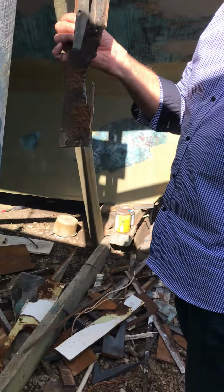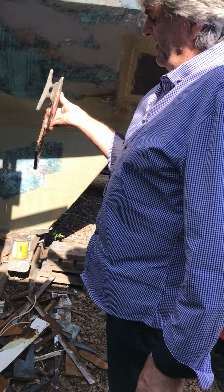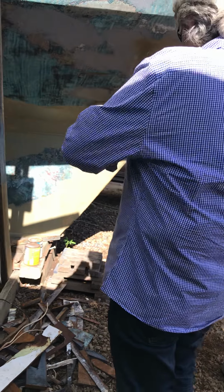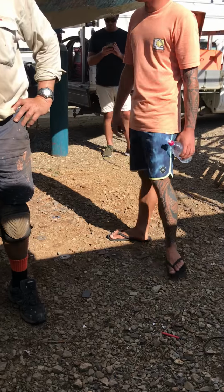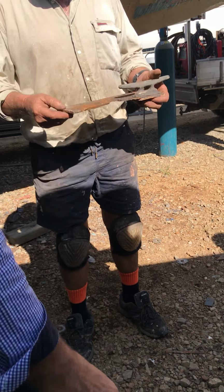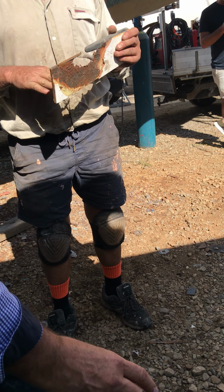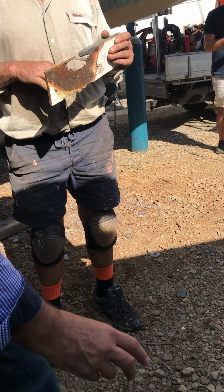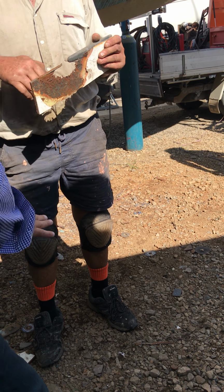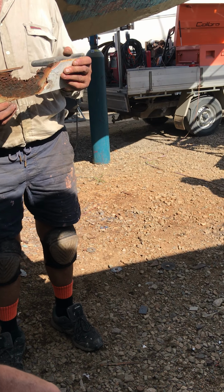Above the deck, along the edge, a nice sharp edge. Right about there, on the top, with a lot of it on the bottom too. So you know what happened there? They got a wood deck on the steel boat. The wood comes over, never seals properly, gets down in there, sits there and it just rusts away underneath the deck.